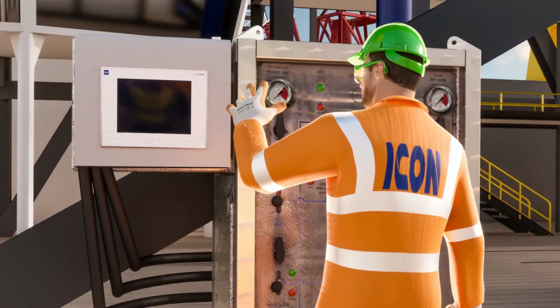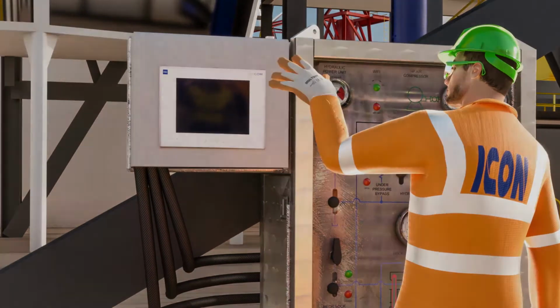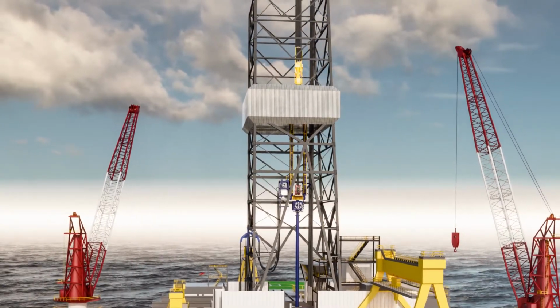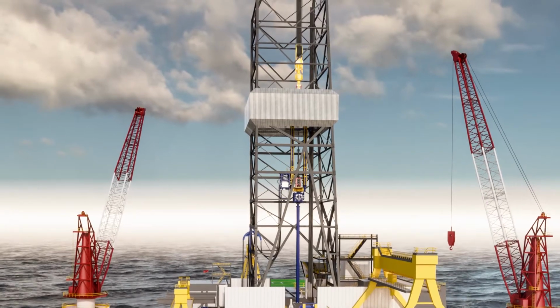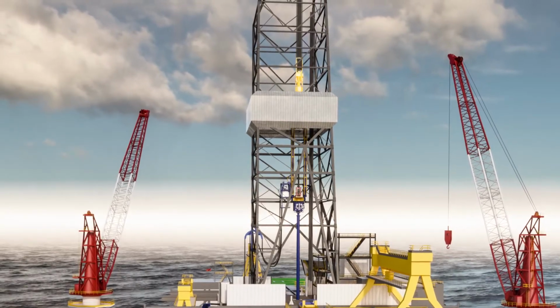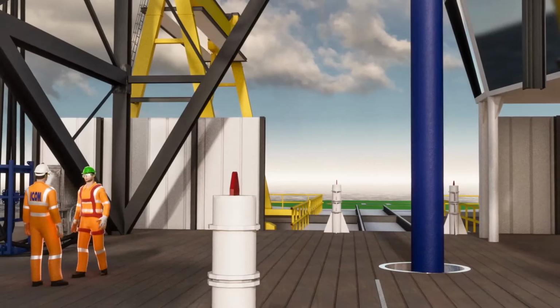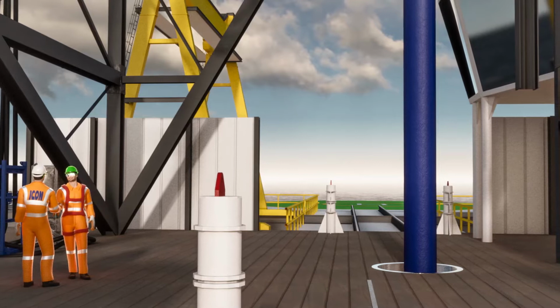Once locked to bottom operations are complete, the driller can put the active heave drawworks back into active mode. Once the AHD has phased, the CTLF operator then switches the compensator back into hydraulic lock mode, and the rig's active heave drawworks will then be functioning as the primary compensator. At this point, the driller can proceed with operations to disconnect and retrieve the completions workover riser.